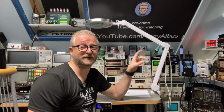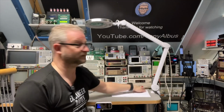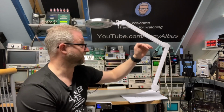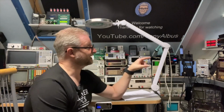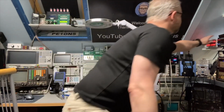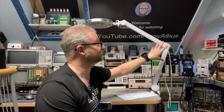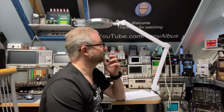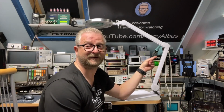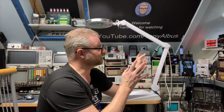Well, I'm still fighting a little bit with the alarm settings, because now I put it on silent, but it actually thinks that it is in an alarm, and I couldn't find out why. If I follow the manual and set my highest level to the highest possible and my lowest level to the lowest, it should not be triggered. Also, if the current is triggered, then the current should be flashing, and nothing is flashing, but the alarm is just going. So this is like the default, and I don't see any value flashing, so that would actually mean that none of the parameters triggered the alarm. But then why is it making a noise? So I will probably try to find out what it is, but I will remove the buzzer or make a switch until I find out. Or it's just a bug, but it is not beeping when there is no load connected. So that is a little bit of a problem for now.